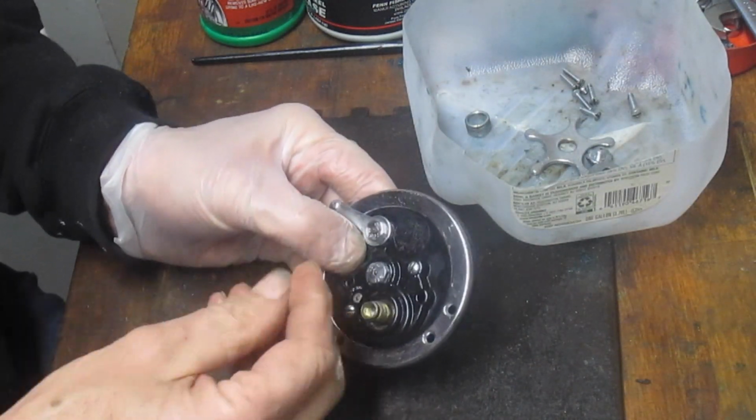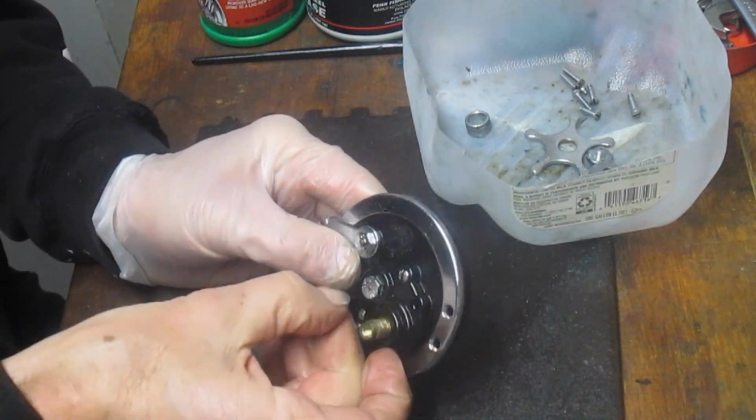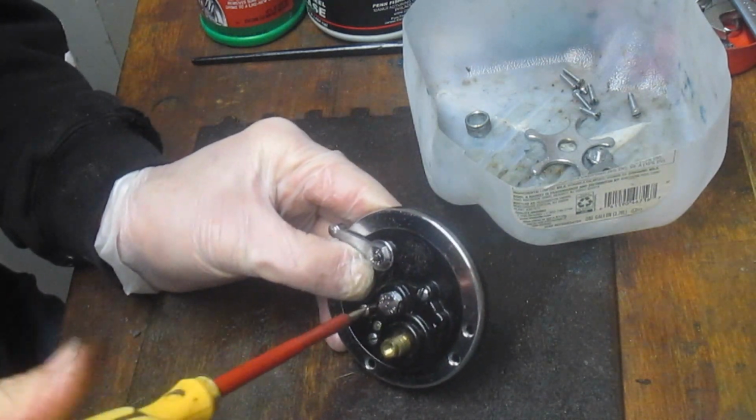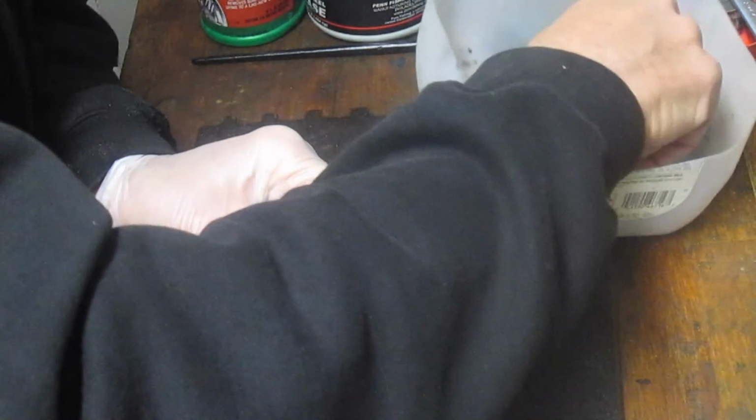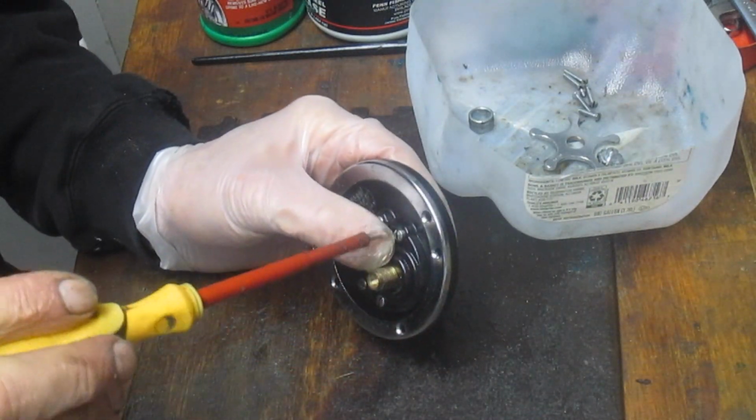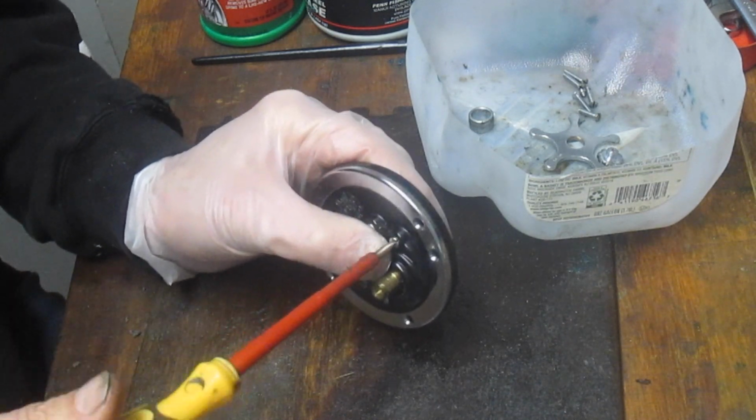And what I do is northeast, southwest. So I've done 2. I'm going to come over and put the other partially threaded screw into the top of this side of the assembly. And then there's one more. It's a fully threaded one, belongs on the bottom of the other side. And again, I haven't tightened any of these down yet. I want them all to catch.